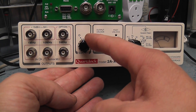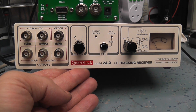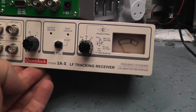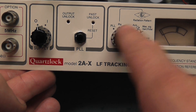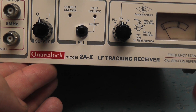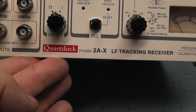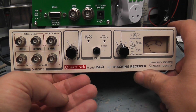The source button and power supply turn it on. There's a phase lock loop button: when you switch on and select PLL, the meter window swings around, and when it has phase lock, it settles in the middle of the display. Receive mode is a signal strength meter — you need it over halfway, ideally a bit higher. DC mode checks the internal rail voltages, which is by-the-by really if it's plugged into the mains.